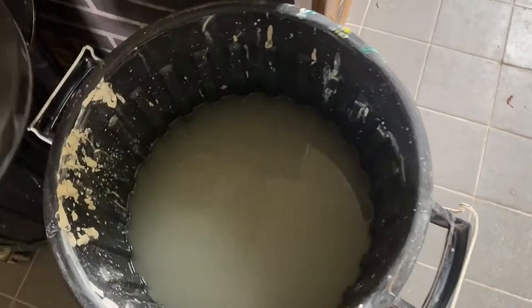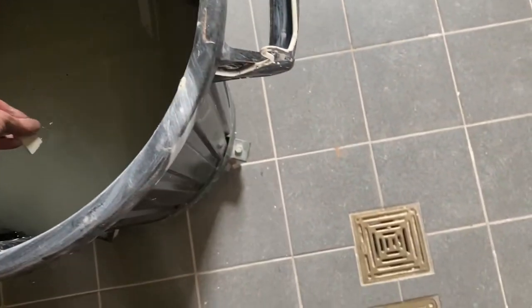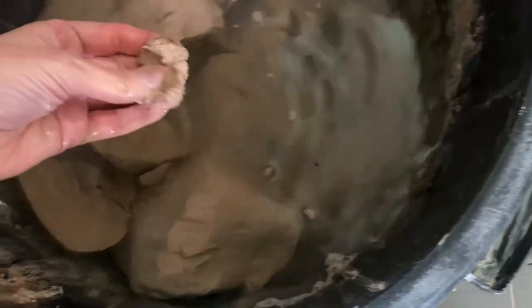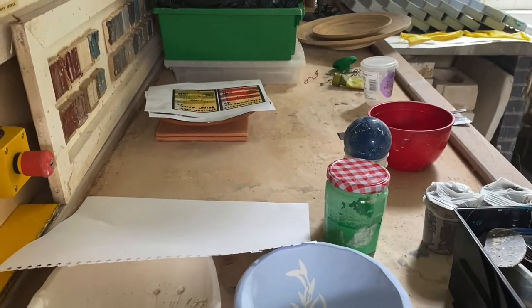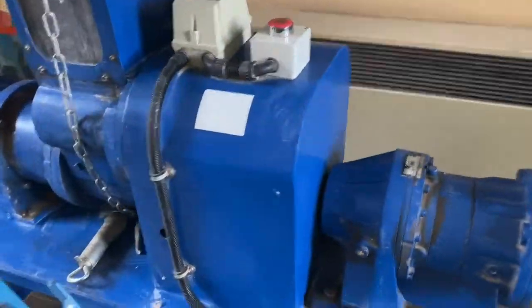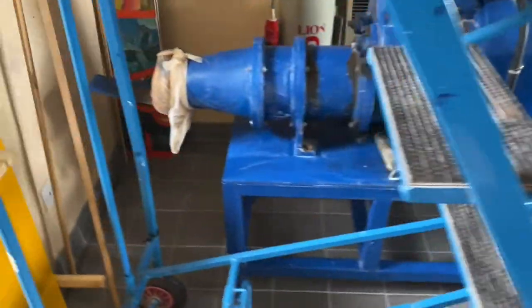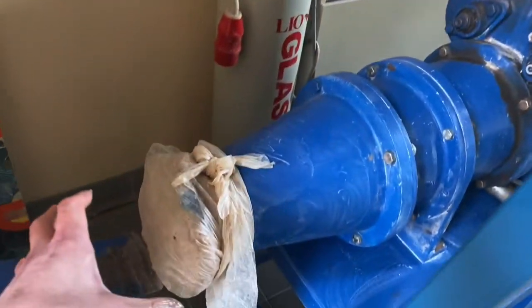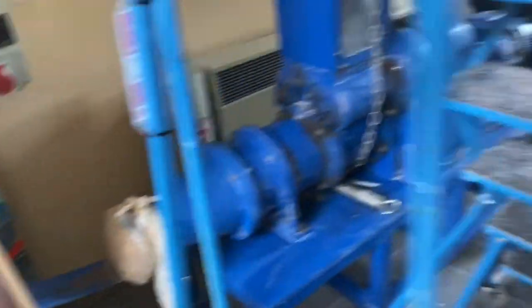In the pottery, we have large-scale bins with water, and we pop in the dry clay. The dry clay soaks down, becoming soft like liquid clay — like a slip. When it has soaked down into a soft material, we pop it onto the plaster beds in the pottery, which absorb a lot of the moisture from it. At that point, it is processed through a giant machine called a pug mill, which grinds up the clay with a big motor and pumps it out as large sausage-like extrusions that can be used in the pottery again.